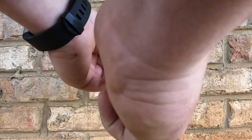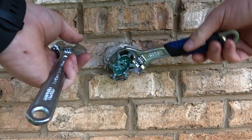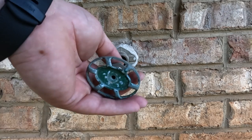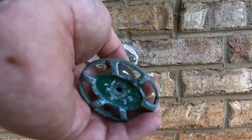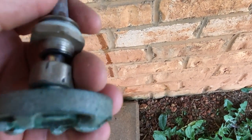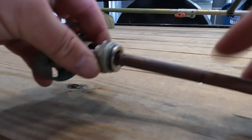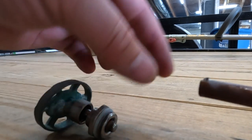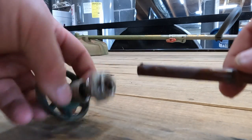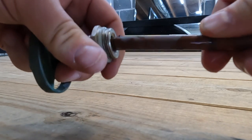I've never taken one of these off, but it can't be too hard. We've got a screw here and a couple of nuts that will wrench off and this thing should just slide right out. Now I think this is where my leak was coming from. I'm not sure if that copper piece is supposed to slide off that easily or be bent. If you're familiar with the design of these frost-free sillcocks, let me know if this is normal or if this was my issue.